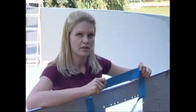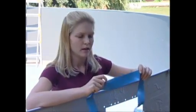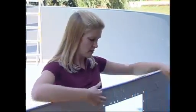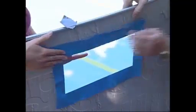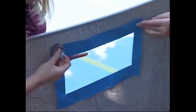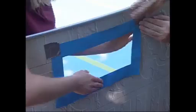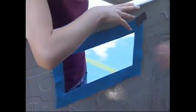With 6 and 12-inch skimmers, you'll need to install a wall saver gasket before adding the liner. It acts as a safeguard against corrosion and provides a watertight seal around the skimmer cutout. Gently spread apart the 2 layers of the gasket and install into the skimmer cutout so that it sandwiches the wall in between the 2 layers. Be careful not to tear or damage the gasket seam.